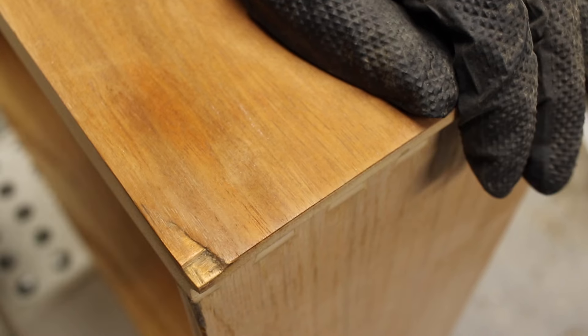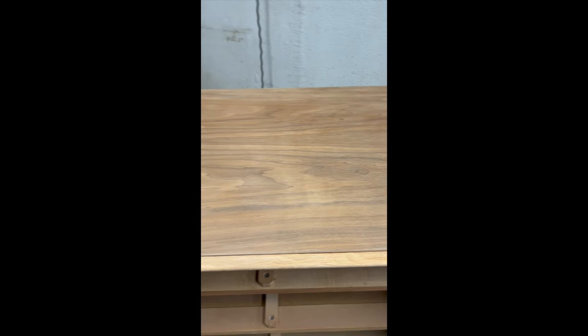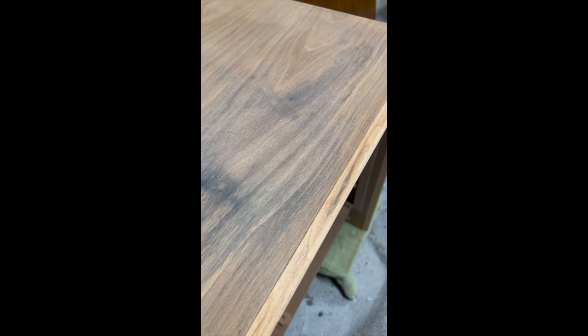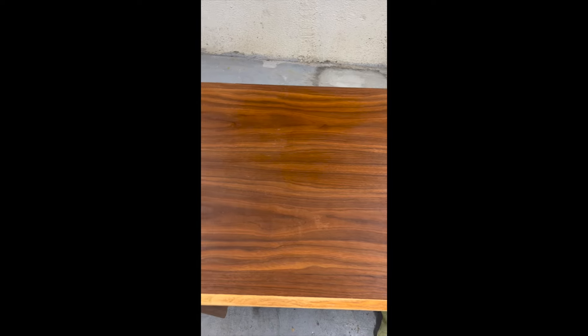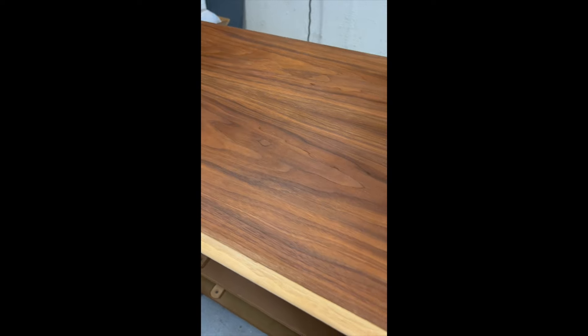Here is the piece all finished, cleaned up, and ready to fill. Unfortunately I didn't videotape the filling part, but what I did was take epoxy putty, fill the little hole, level it out with sanding, then stain and paint it — and you barely notice it after that. The top of the dresser after stripping and sanding looked pretty good except for a big black stain on one end. From previous experience I knew I had to put some oxalic acid on it to bleach it out. It took two applications and the stain disappeared — very, very little was left. I knew that once I put the General Finishes stain on it, you wouldn't even notice whatever was left of the black area.